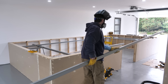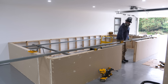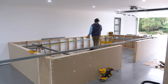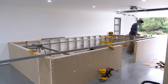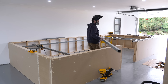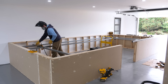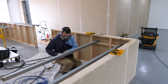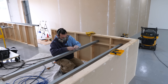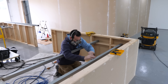Now doing the next long section of steel which will support the back part of the desk. These are eight-meter lengths of 50 by 50 at three millimeters thick — very heavy-duty steel, extreme overkill for the desk, but I had it on hand and wanted it nice and strong. Flipping them around in the space without putting holes in the wall was a challenge. Clamped one end, tacked to the other, and it's now in place. Lots of measuring, rechecking, and marking throughout.